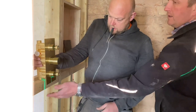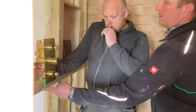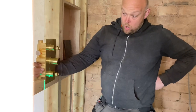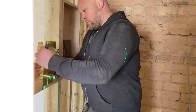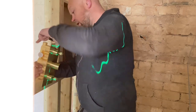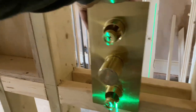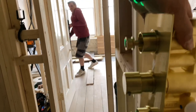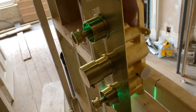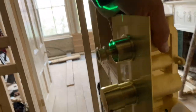I'd probably have that bottom plate the other way around. I've actually got about 22mm to go on top of that, plus you've got plasterboard on top, so we've got that much of it. Ideally you want a nice bit on show. Right — so we've got the centre of where the bath is going to be, all the way up, so the valve is going to sit give or take there. We just need to work out the depth of it sitting off this wall to allow for tiling and plasterboard. The chippy's just going to make a stud for the back so we can partition that back bit off and fix this to exactly where we want it. We put the cover plate on the front so we can get a realistic look of the depth it's going to need.